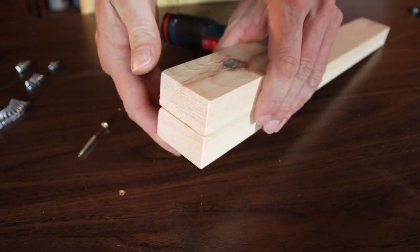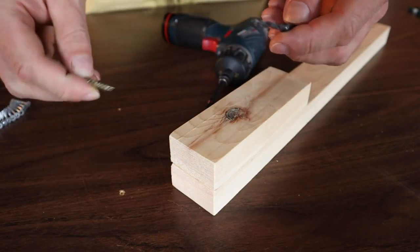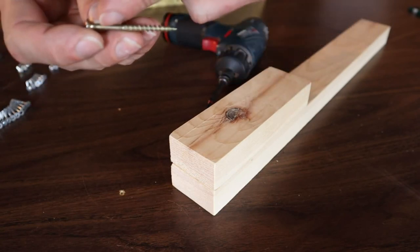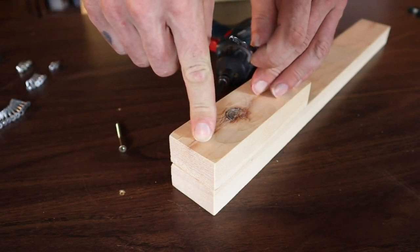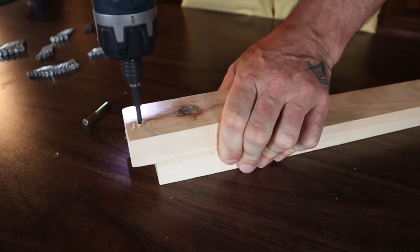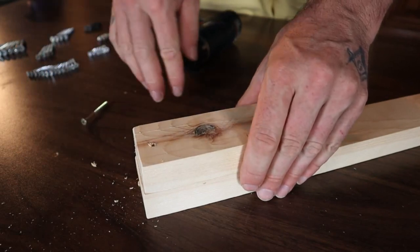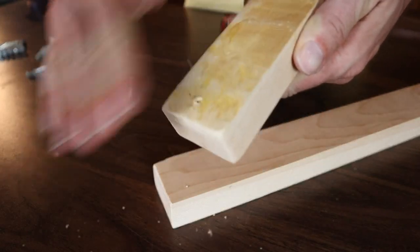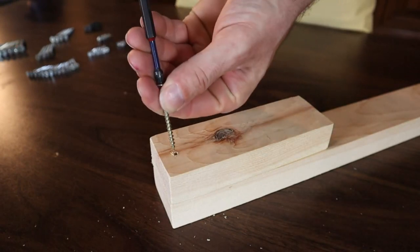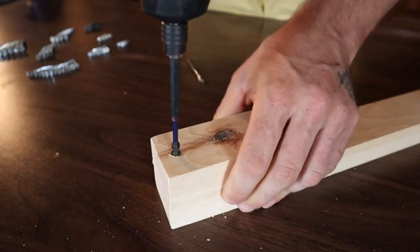Having a blank collar on top will allow it to tighten right up tight. Another way to prevent pieces from separating is to drill a pilot hole in the first piece. You get a drill bit where the diameter is the same as the shank of the screw — the smooth part — drill into the first piece, line it up with your second piece, drill through into it, and that's going to help keep it nice and tight.